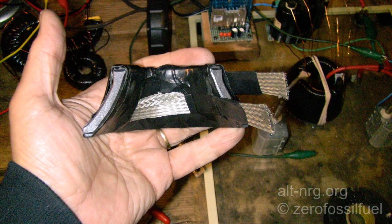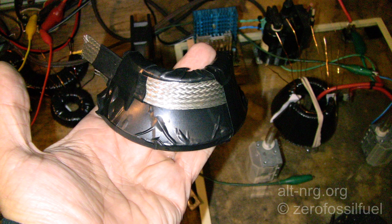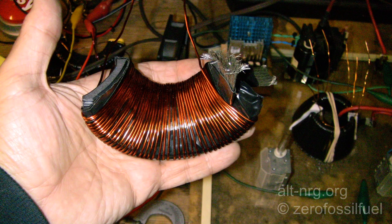In this first photograph I'm holding the larger bell-shaped ferrite core with the one-half turn braided copper wire primary. You can see the ferrite core is very well insulated with electrical tape, as well as the ends of the braided wire, so that when I'm injecting high voltage I don't get any arcing to the ferrite core itself. Here's the backside showing how it's taped into place. Here is the primary side wound with the 50-turn primary — actually 46 or 47 turns, since with the gauge wire used I didn't have enough room for all 50, but that's close enough for government work.